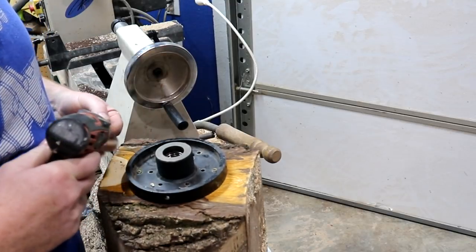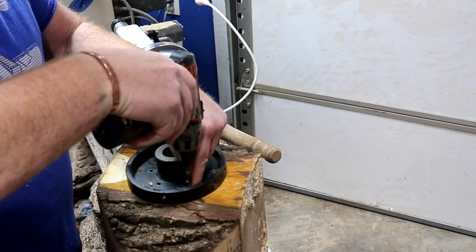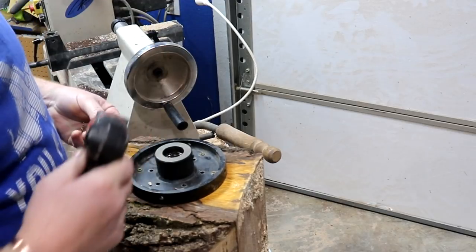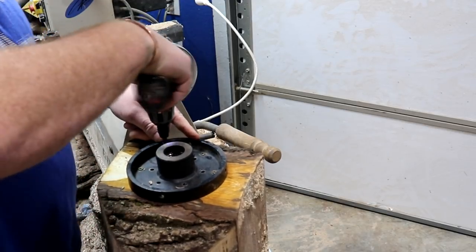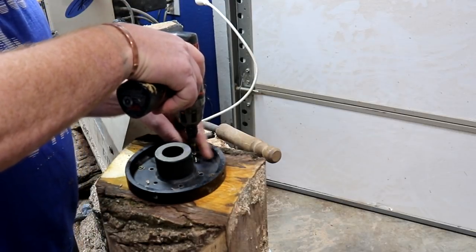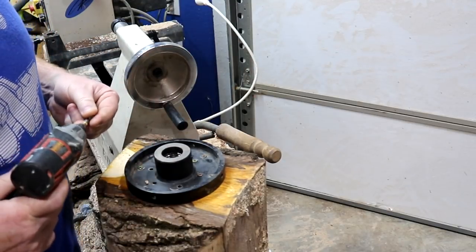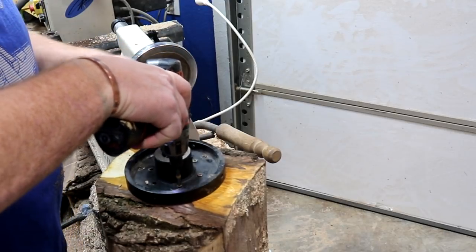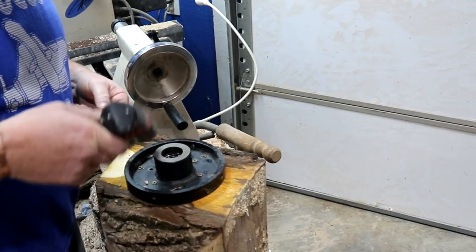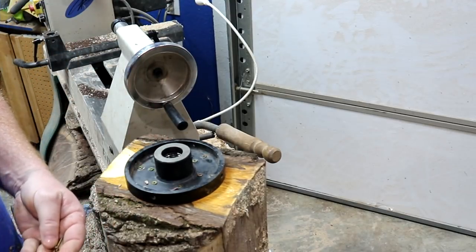Big old chunk of walnut. I'm going to use some one-inch screws — not drywall screws — and I'm going to put it in every hole of my large faceplate, and then proceed to make a huge mess, in hopes that I can get three, four, five of them done and dried for summertime. Ideally I would use two-inch screws on this, but I want to use as much of the wood as I can. So we're going to do one-inch — there's twelve screws holding it on. So truth is, unless I do something really crazy, that should be sufficient.